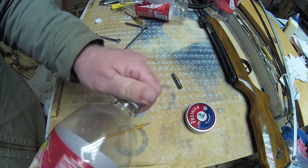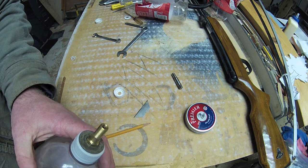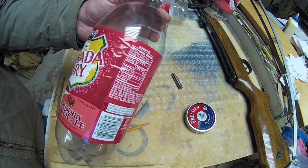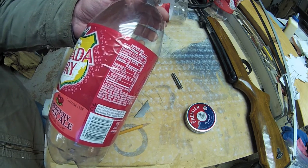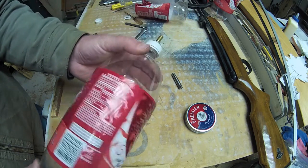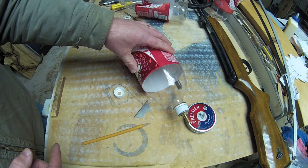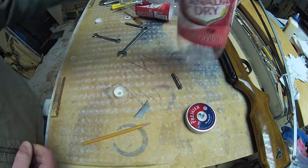What you do is screw it on and pump it up. It's been my experience that they pop real nicely at the 90 to 100 PSI range. However, the internet tells me that these things start exploding at the 120 PSI range. It's not going to take your head off, but you aren't going to be using your hands for a while. So at your own risk — you'll just have to experiment on your own. When I pressurize it, I wrap it in a towel, put it on the ground, kind of up against the wall, keeping my fingers back — kind of like airing up a tire.